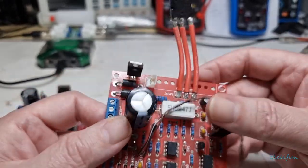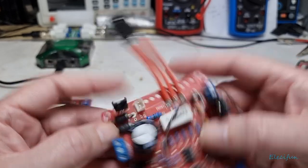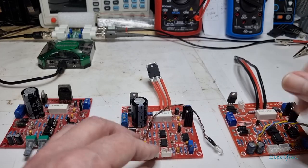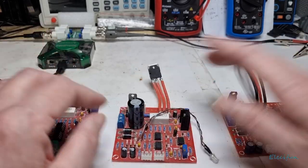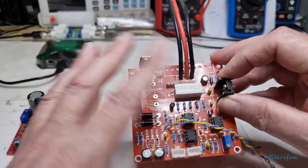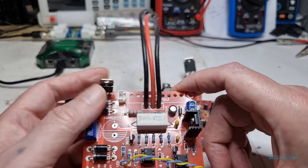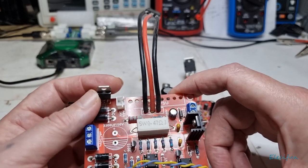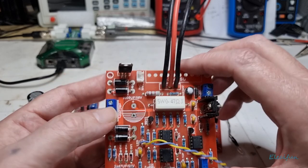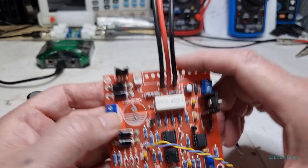The other stark difference is the voltage regulator, which regulates 24 volts here. You can use different voltage regulators if you like — you can even stick a 5 volt regulator on there, just don't try to pull lots of current through it unless it's attached to a heat sink. This one does work and will get you up to 30 volts, but there is a little bit of an issue with the noise that comes off the regulator when you check. There's a lot of noise there, so I would say this is a slight fail as well — but it does get you 30 volts.